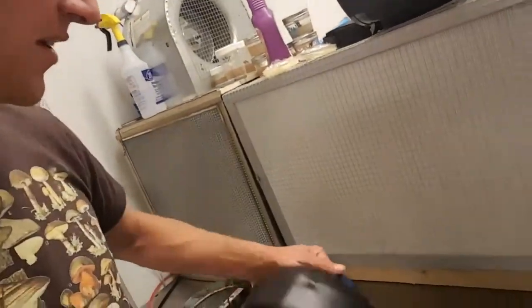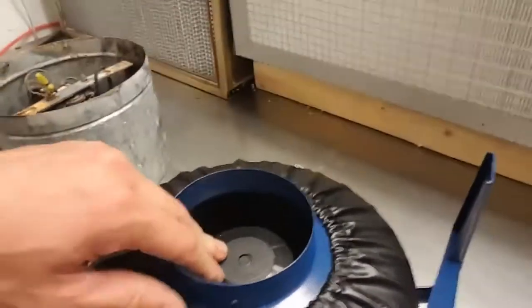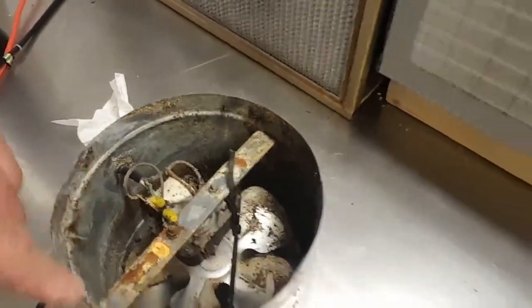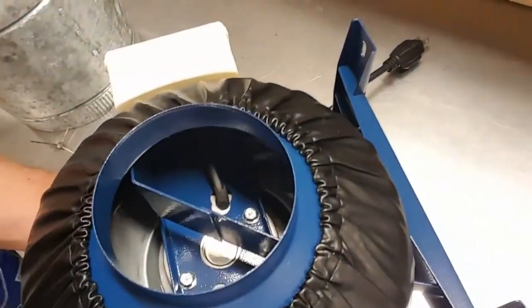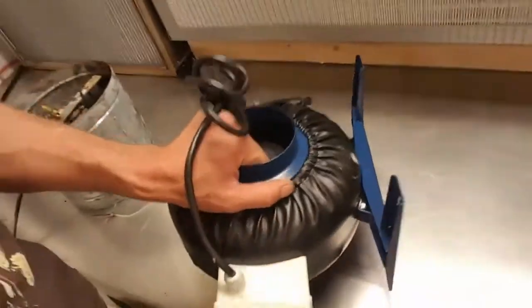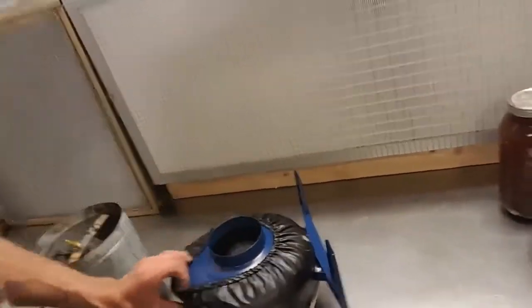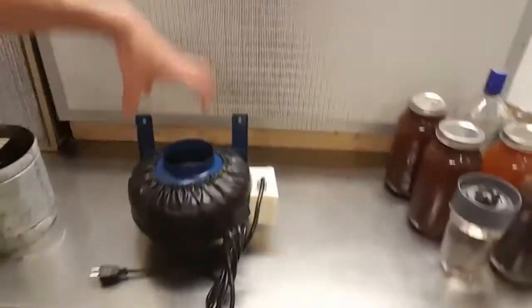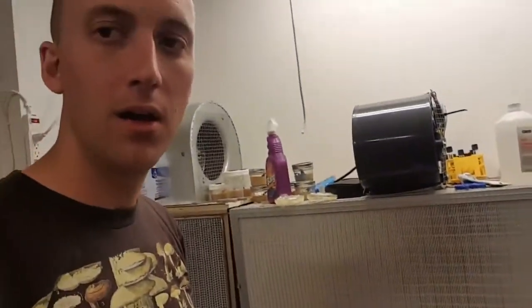So that's a quick overview of fans. These new ones just came in and I wanted to show you the difference. You can see the motor in the Vent Tech fans is kind of inside — here's the intake, the blades, and the motor is behind it — whereas on the inline fan the motor is right there just getting spat on. I'm sure it's a sealed motor but once a year or every six months you have to take these apart completely. You split them down the middle — there are bolts and the housing splits in half so you can really clean it well. I'd recommend doing that at least every six months to a year, especially on your exhaust or circulation fan, because they build up spores in all the nooks and crannies. In the meantime you can hose them down, but you still need to do the big overhaul at least once a year at minimum.